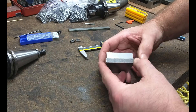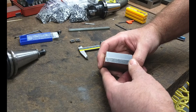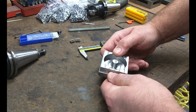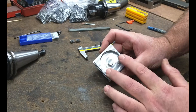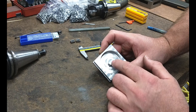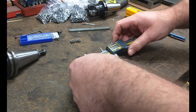The side finish is pretty good. There's a little chatter on the front side — or I think that was the back side. Yeah, it was. You could actually hear it. It's supposed to be two and a quarter by two and a quarter with a two-inch ID, and then a post with a half-inch OD. Okay, so let's see how we did.